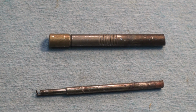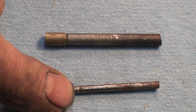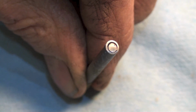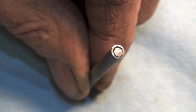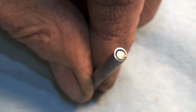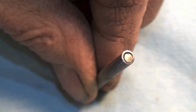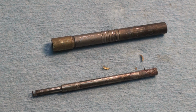Okay, here's the thermocouple kind of taken apart. Here's the stainless steel portion, the outer portion, and this is the copper portion. See, this actually fits inside like that. There's a very thin insulating layer in there so that farther down they don't short out together. But the inside's a copper, the outside's a stainless steel. They are bonded together. It's brazed, welded, something at the very top, and that's the hot junction. Okay, that is the two metals that make up a thermocouple.